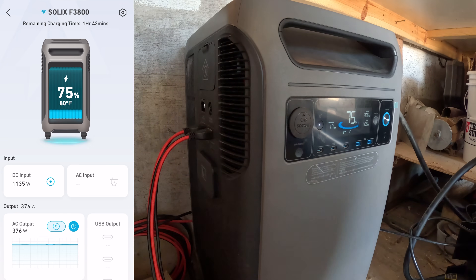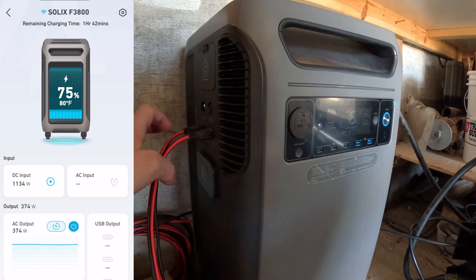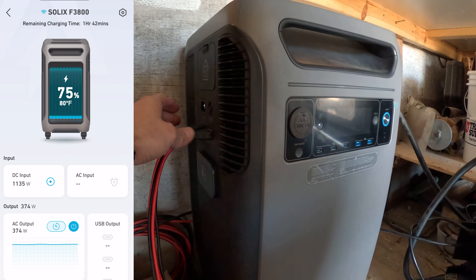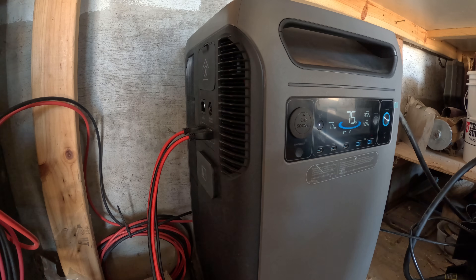One thing I've found with this unit is if the temperature is below 50 degrees, it will reduce the charging speed on both AC and solar. So if you have this in a cold garage, it will not charge at maximum speed. If you have solar plugged into both ports, it will only pull from the front port until the unit warms up to 50 degrees. If you have something plugged into the back port it'll pull from there, but once you plug something into the front it'll automatically switch to the front port. Once it gets up to 50 degrees, it'll start charging from both ports. We've been using the generator for about two or three weeks and it has only tripped once on an overload — because we were running the microwave, the air fryer, and the well kicked on at the same time, which was just a little too much for it to handle.